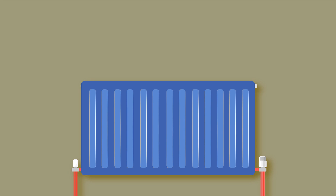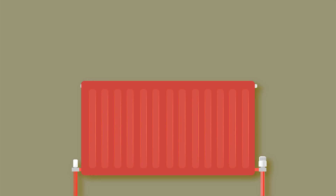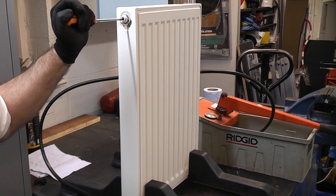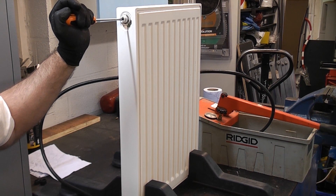As soon as the radiator is turned on you can see the heat transferring up, but because there is air trapped at the top the heat cannot go all the way to the top. By fitting an auto vent the radiator is bled all the time, so there is absolutely no air in the radiators, meaning you get the full effect of the central heating. Normally you'd have to go around and bleed the radiators using a screwdriver or a bleed key, but with an auto vent you will never need to do that ever again.